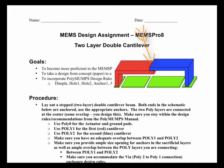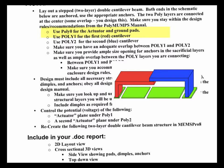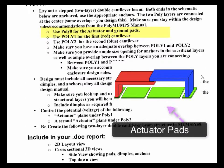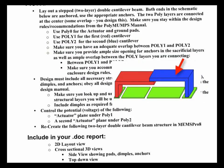There's a different way of anchoring poly 1 to poly 0 compared to poly 2 to poly 0. The two poly layers are connected in the middle, so you've got to overlap the two cantilevers somehow and connect them, because they're going to be floating in space. You're going to have to make a hole through the oxide that's separating the poly 1 from the poly 2 structure. You're going to use poly 0 for the actuator and the ground plates. Poly 1 is the red cantilever and poly 2 is the blue cantilever.